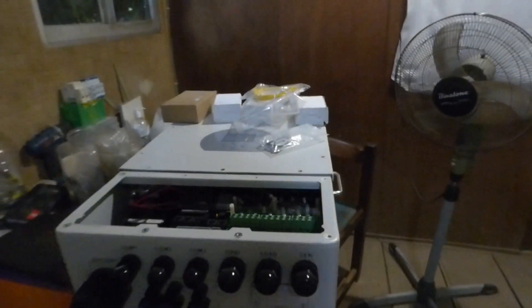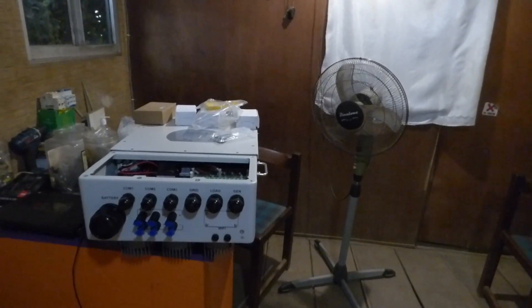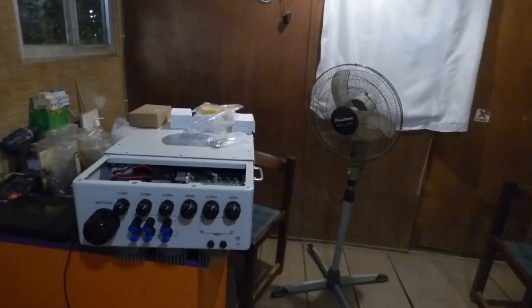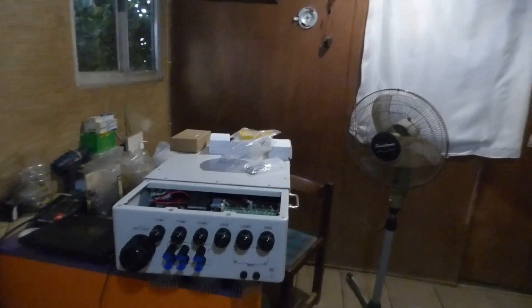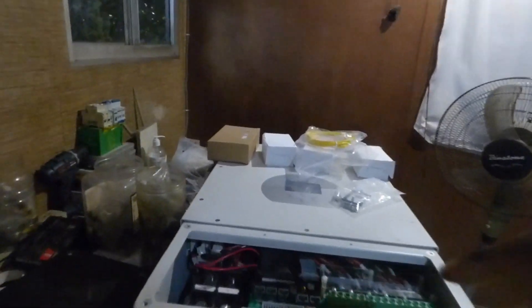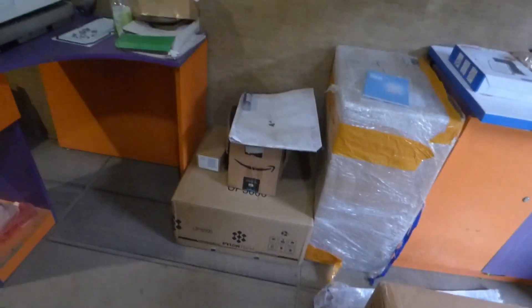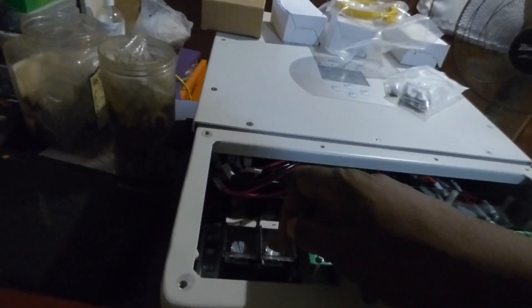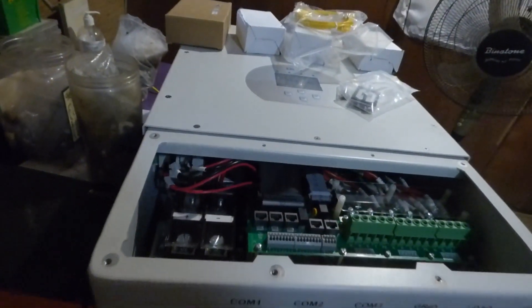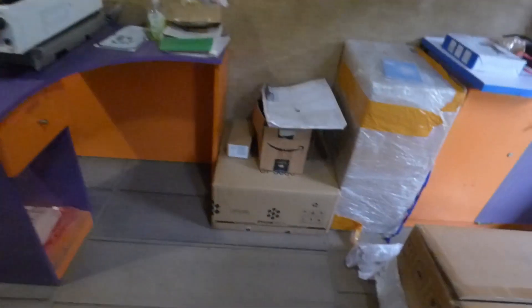So I'm pretty psyched. I'm going to run this sometime this weekend. If I don't run it this weekend, I'll definitely run it on Monday. The big challenge now I face is that I do not have battery cables that are big enough to fit into this and at the same time fit into my Pylontech. So what will end up happening is we're going to have to fashion special battery cables, so I can put a bus bar to allow me to use this inverter with that battery.